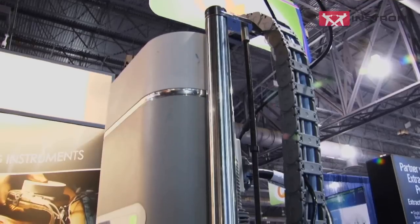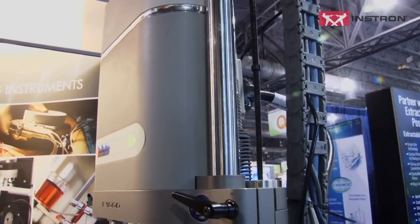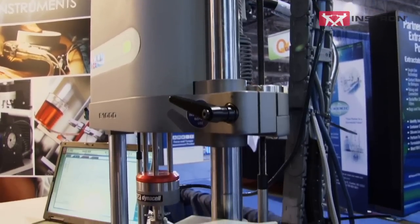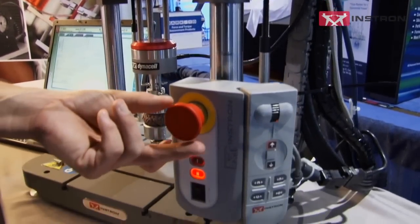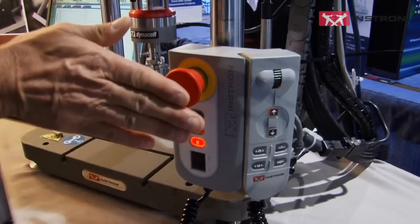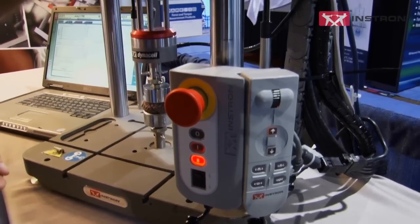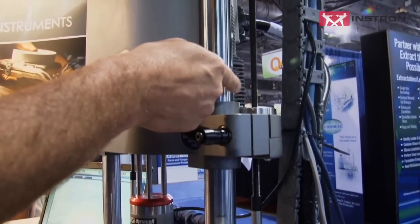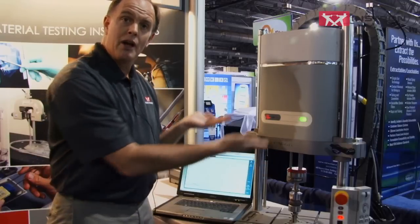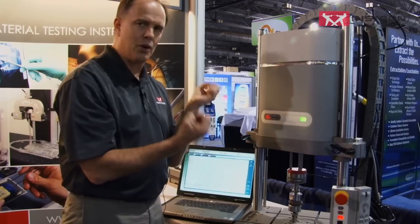Focusing on the ergonomics, one of the most important features of this revolutionary new product — the ElectroPulse — is the ergonomic and safety features built into the system. I've got the handset here that we can use to actually start the test. We have the emergency stop button in case something in the actual setup would require an emergency stop — we can depress that to stop the test. From an ergonomic point of view, up above, you can see the mechanical drive system which allows us to automatically set the height of the test, and an electric motor that allows you to automatically lift the crosshead to accommodate different specimen sizes.